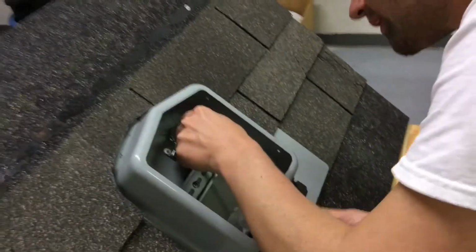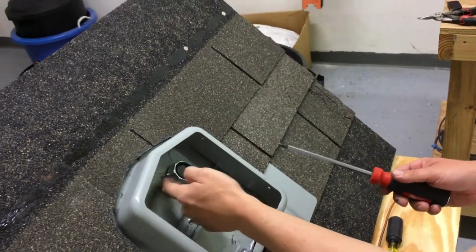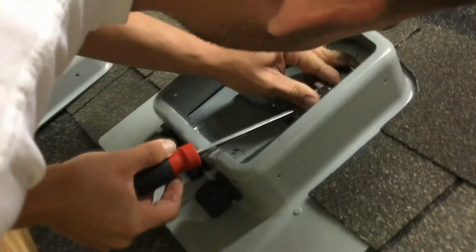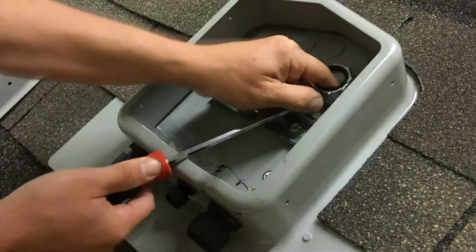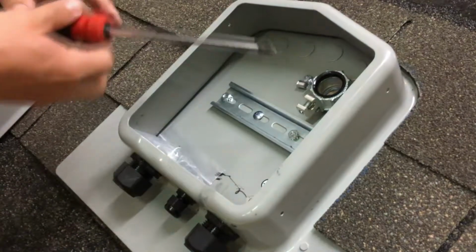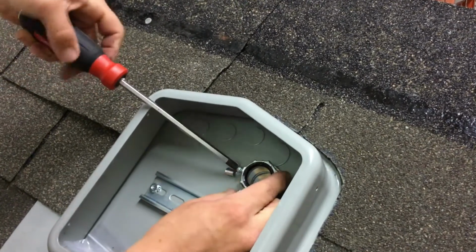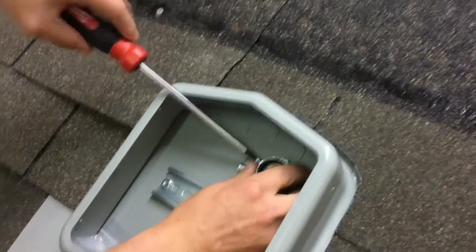Does the fitting have to be tight? It does not have to be tight, because you're going to penetrate it with this screw. So go ahead and lock this down. You want to hold the lug straight while you do it. But you want this lug to end up down here or somewhere where you can access it with a screwdriver. Then you'll come in from an angle and go as far as you can with a screwdriver. Tighten up your set screw.